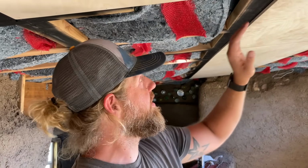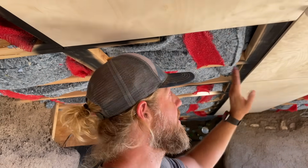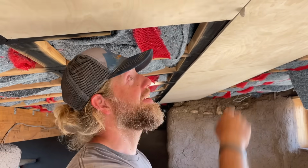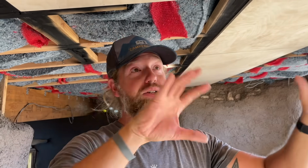So we promised we would explain this whole negative reveal thing. So here's how it works. You can see we're using our rafters that go this way, and then we're adding purlins, I guess that's what you call them, that run this way, and we paint them black. Then we're just using some quarters, 2 quarters taped together, very scientific. We use that to make sure the space between the panels on all sides is the exact same amount. That way you've got this black background between them and the panels, and you get that nice separation. And that's a negative reveal.